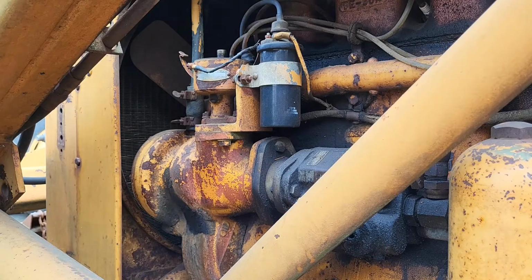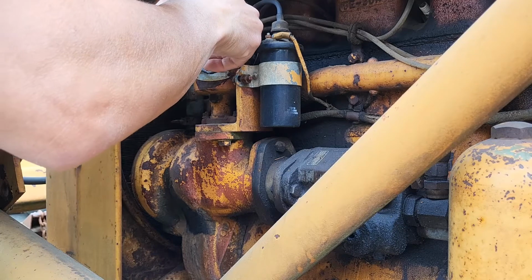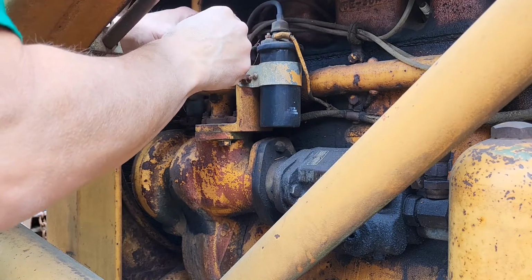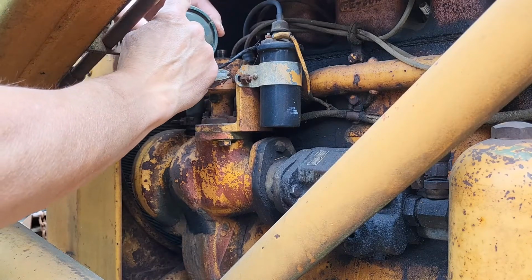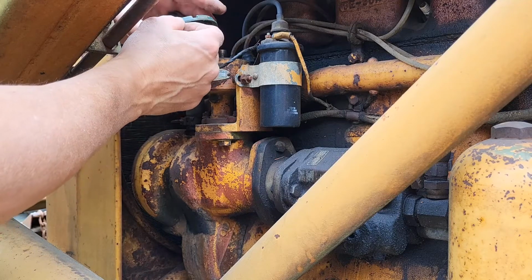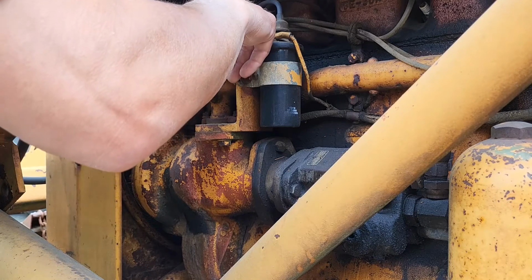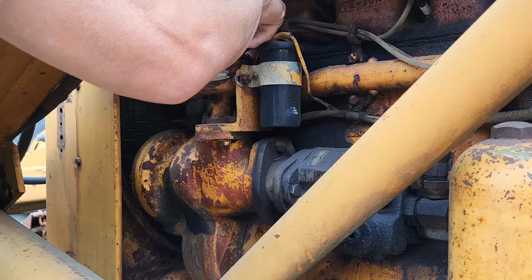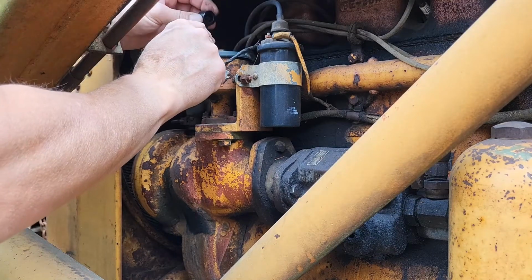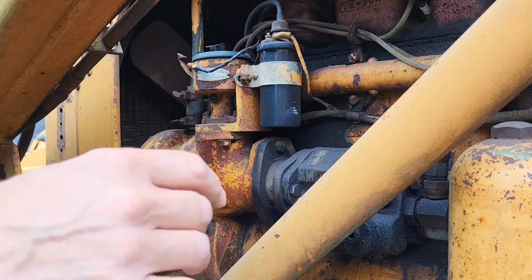All right. Step one, put the dust cover on. Now these things have a spot where it does need to sit. It has a wide spot here for a wide tab, so it's only going to sit in that one spot. Like that. Get the rotor back on again. It has a little notch on there and a notch on there that line up. There we go.